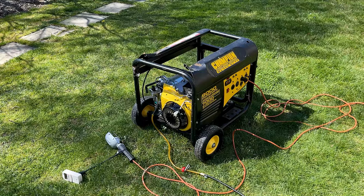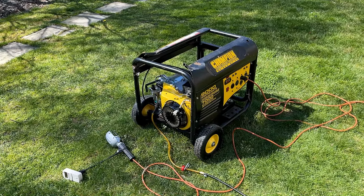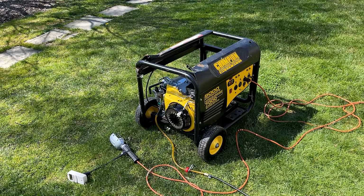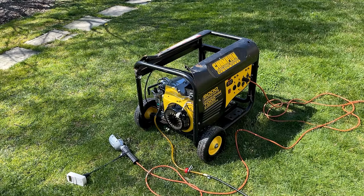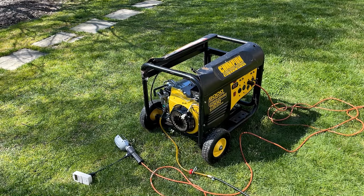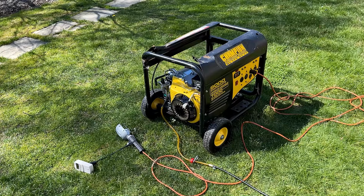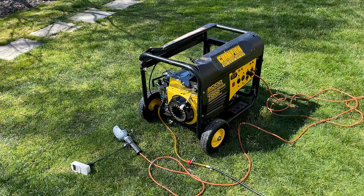This actually has an overvoltage protection, which most don't have. You know, when AVRs fail, either they fail and the power goes out, or they fail and the power goes to 170 volts. And I have seen a few generators producing 170 volts like this one was, and it just kept running like nothing was wrong. So I'm starting to like this generator. It does have a lot of nice features. Anyway, we'll get it back inside, try to figure out where to go next.